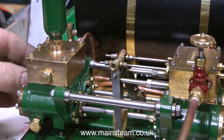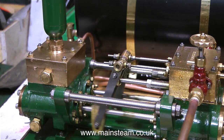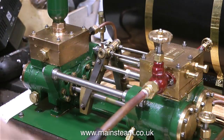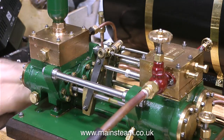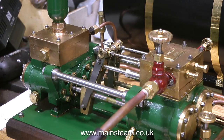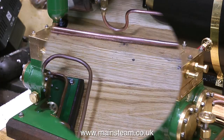As you can see there are one or two drips still around it and I will be fixing those before I finish the steam plant. The pump seems much happier than it did — it's running very well indeed. There are some leaks around the steam side of this pump so I'll probably have a look at those at the same time. It's best not to get too paranoid about small steam weeps from gaskets and things like that — it happens.